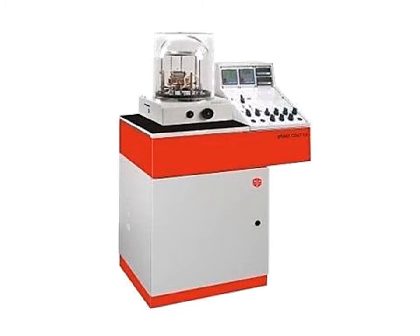Here you can see the system diagram, not a block diagram, how the system looks. If you see the system, there is a bell jar, under which you can see the multi-target turret. There is also a quartz crystal monitor inside. And other facilities if you opt for them, since it is a customized system, like a plasma cleaner, so you will have a plasma electrode inside, and the rest of these things. You can also have electron beam ablation inside, but we have not opted for this in our system.